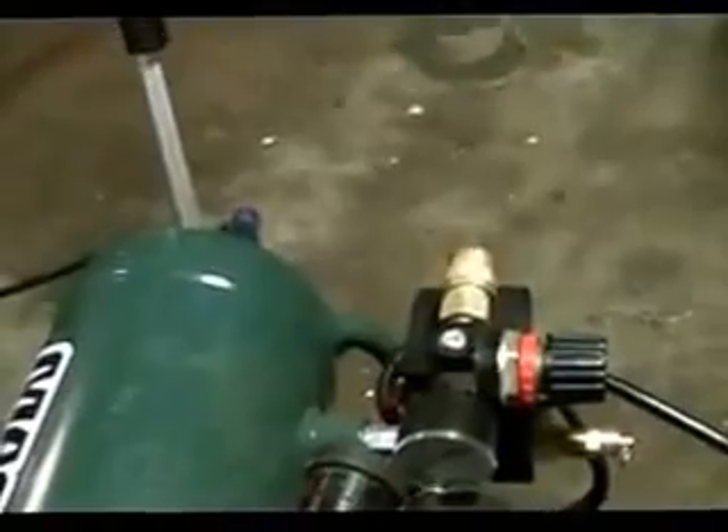For example, if you're doing fencing work and trying to nail pickets onto the 2x4s, you would want to dial the setting down to a low setting so that your nails don't go all the way through the pickets and can sit flush. As you can see right here, there is a quick connector — these things are awesome. The unit is a little bit heavy but easy to pull around. It's got rubber isolation feet that help cut down on the noise. It's a four-gallon tank, with a first tank drain here and a second tank drain here.